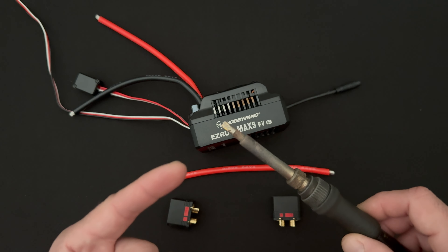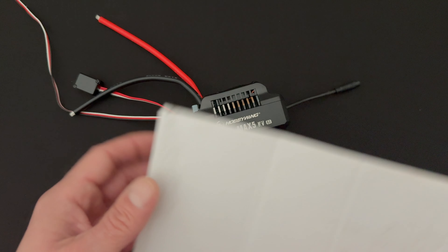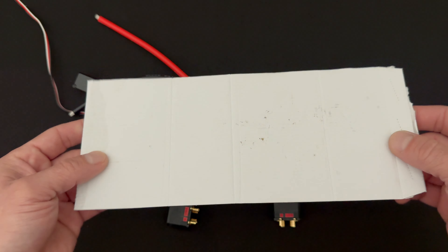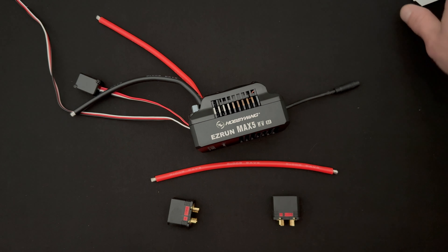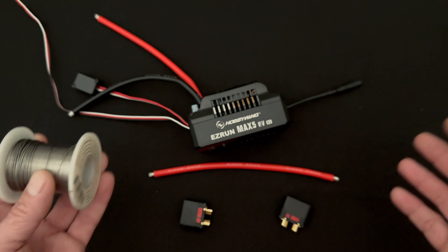If you're getting into doing custom rigs, do yourself a favor and get a soldering iron with a decent size tip. You can put a smaller or bigger tip on - there are lots of options. I always recommend getting a piece of cardboard and doing most of your soldering on top of it so that when solder splashes, you don't melt holes in your table.